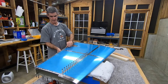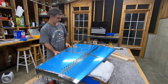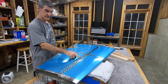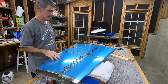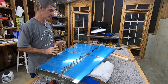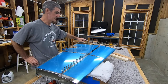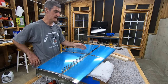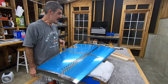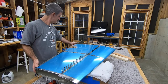It's sitting on boxes, but the spar was able to sort of turn out a little bit. The rear spar should be okay — it's really important just that this is solid. The other side basically has a rivet or a cleco in every possible hole. The plans tell you to only do one side at a time, so I only cleco one side at a time because the other side is what's holding the shape.